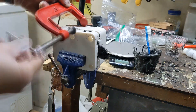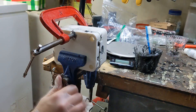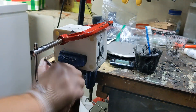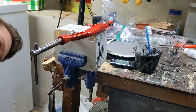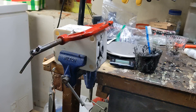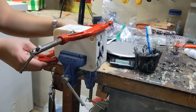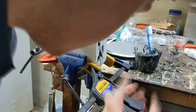The last step is to clamp the mold and give it the compression that's going to squeeze all of the resin out. I just used a small bench vise for this. I designed holes in the mold for half-inch bolts but didn't use them, and I kind of regret that because I actually ended up putting a bolt through one of the holes to help squeeze it shut, and it was a lot easier than trying to use the vise and C-clamps. I actually snapped one of those C-clamps in half — the bolts would have been a much easier solution. You also have to gradually close the mold over the course of 10 to 30 minutes; if you try to do it all at once you're just going to blow the mold out because the resin won't have time to squeeze its way through the gaps.